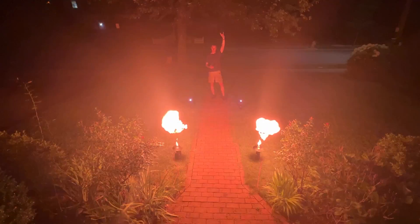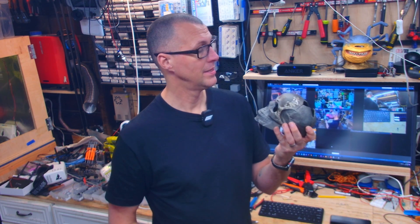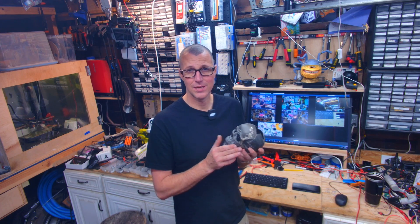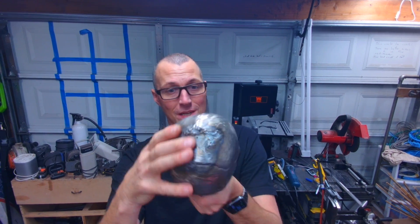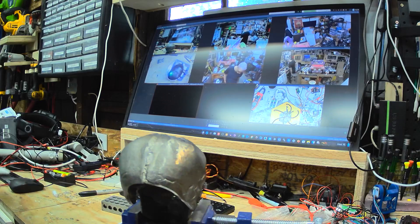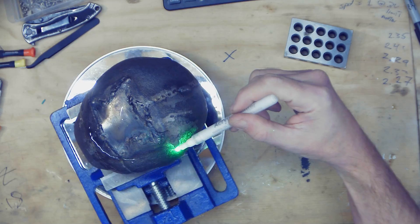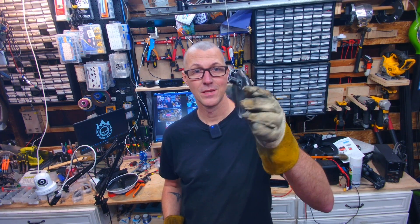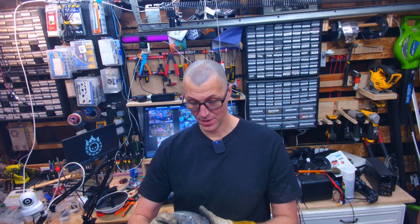But that's not enough for me. We need fire — that was in the opening. Luckily, I've done projects with propane and high-voltage igniters before, so this should be trivial. Why buy one metal skull when you can buy two for twice the price? This says cast iron in the description, but this looks close enough to mild steel that I'm going to see if I can weld it. I weld it, I closed the top part. So now I'm just going to cut it. This is a one-quarter inch NPT nipple. Now we get to test plumbing some propane into it to see if it will have the desired effect.